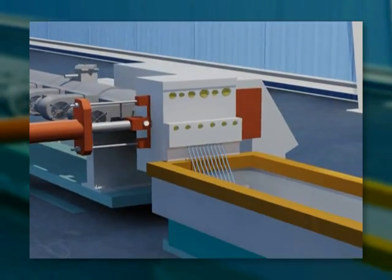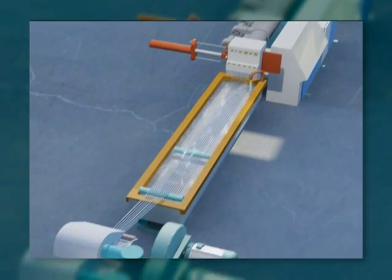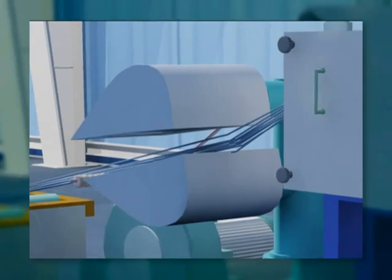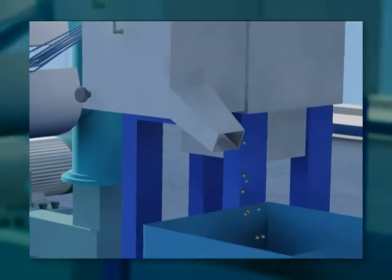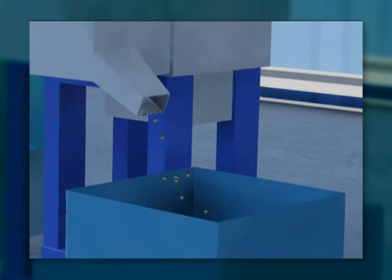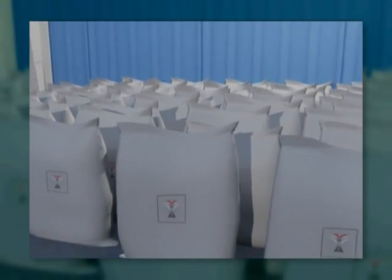The extruded plastic pieces are water quenched and cooled, and then sent through a gale dryer for dewatering and drying. Finally, the extruded plastic is passed through a granulator to be made into tiny granules. The granules are then weighed, packed and sealed as per the requirements.